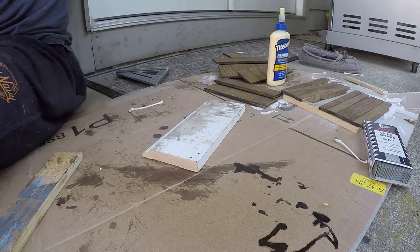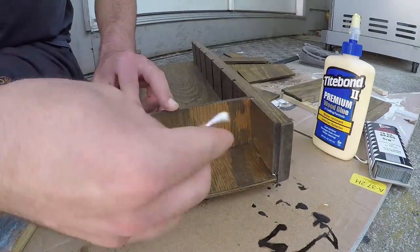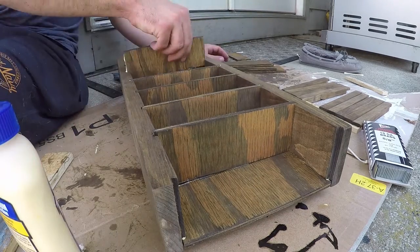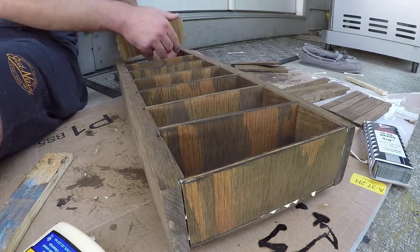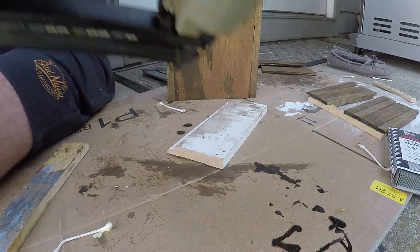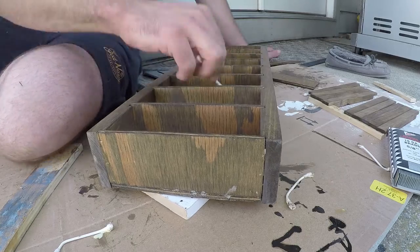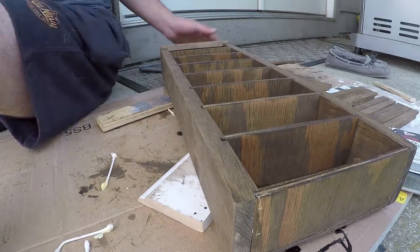Repeat for the other side rail, then test-fit one of your bottom shelves before installing. Apply your glue, insert it into place, and don't worry if there are some gaps at first. Get all the shelves in, then tack the very top and bottom shelves in place with a nail — that's what holds the whole thing together. When putting on the top board, I'm not using a clamp because I don't want the sides too bowed in. I kept them relatively straight by hand based on where the wood naturally stopped, though you could use a square. Rapidly change out Q-tips and wipe up all excess glue from all seams, corners, front and back.